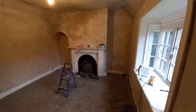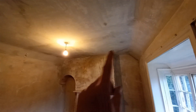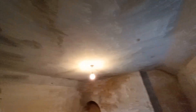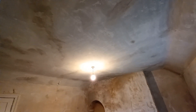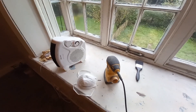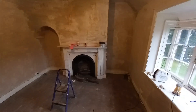This morning's job - I'm going to have a go at emulsioning the ceiling. It's not perfect - I've noticed there are still small cracks there, but we'll give it one coat of emulsion and just see what it looks like, to see if we can get away with patch repairs. I'm pretty sure we can. We've done some repairs already with one or two more to do. Before emulsioning, I need to give it a rub down all over with the palm sander to give a good key. I've got the oil heater keeping the room warm.